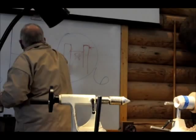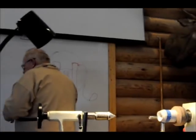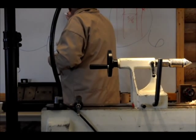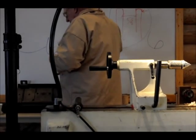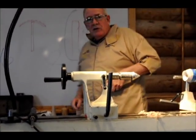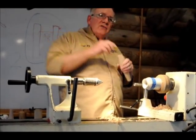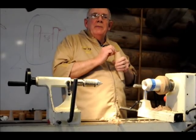There's a tool, one of the fancy carbide tools, and I'll show you a picture of it. They're gold in color. You've got the shaft here, and the top with the curve on it, and your carbide up there. I really like those because I can take that Dremel now, and it's curved the right way. I'm not putting a square surface in there, and I can feel it with my fingers so that I don't have any bump in there.